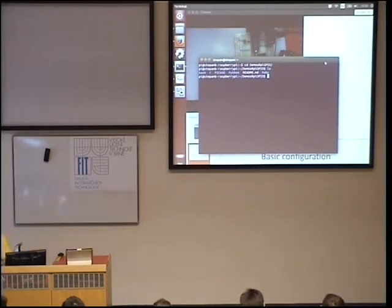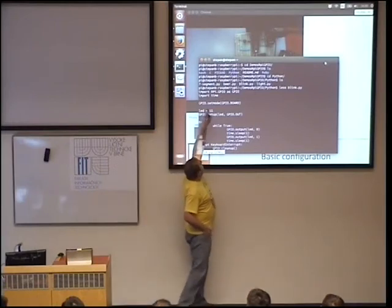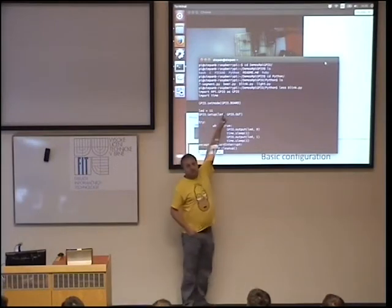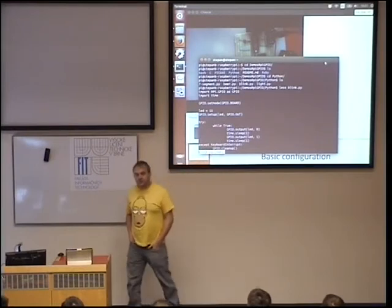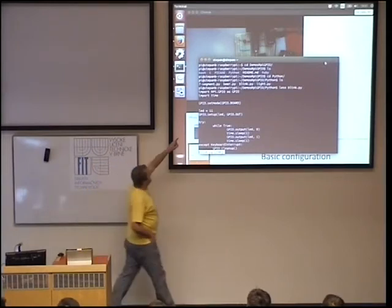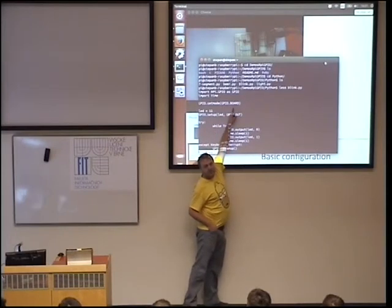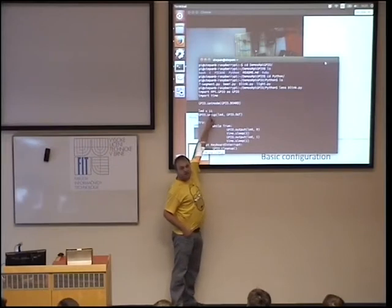So let's go to Python. So yeah, very simple application. The RPi.GPIO module is pre-installed, so you don't need to install this module. And this module can control pins. I am using the GPIO BOARD pin convention. It means I am using the number of the pin on the connector. Or you can change it. You can use the name of the pin.